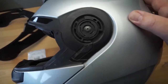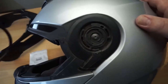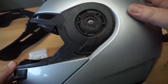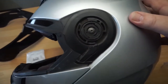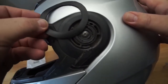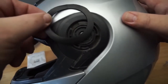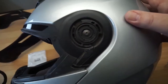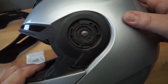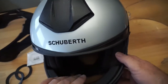It is important that you get the right thickness because I tried a thinner o-ring — I tried several sizes — and of course the thicker it is the more it stiffens up. You could also just take a sixteenth-inch rubber gasket material like I did here, but it was too wide and created a little too much friction. You have to be careful that you don't put too much on there, because since the parts are plastic, too much pressure will probably wear those parts extremely quickly.